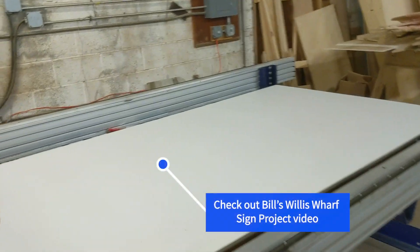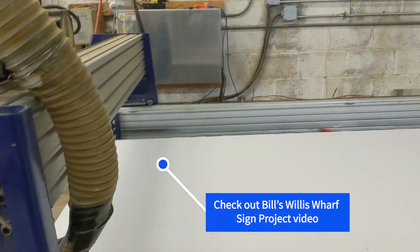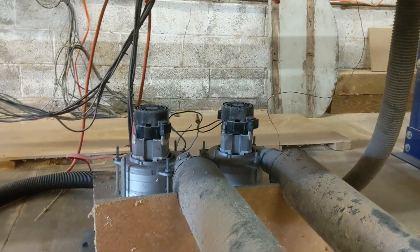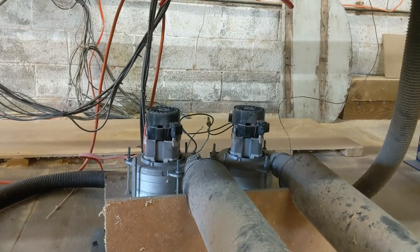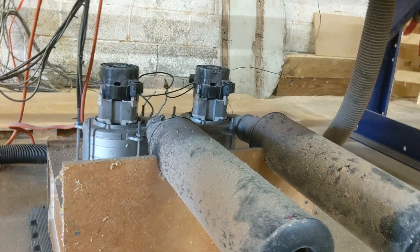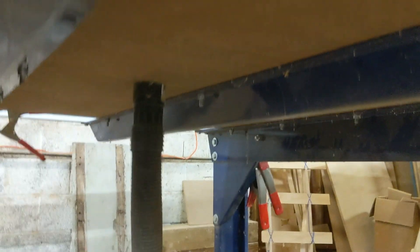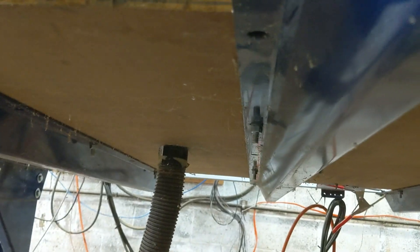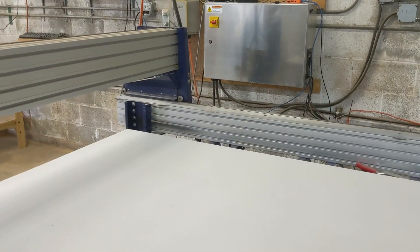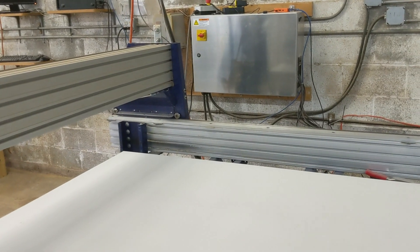At the moment I'm getting ready to do a new sign for this little town I live in, and I've got an old vacuum hold-down system — I'll see if I can show you that. It uses two of the Lighthouse Industries motors, the central vacuum system blower motors, just piped into an accumulator box. Then I ran regular old shop vac hose up into the table in two spots. Almost everything I cut is full-sheet plywood, so I have one big zone here, ducted in two places to spread the draw.